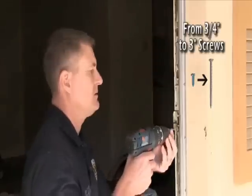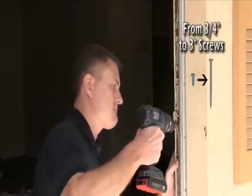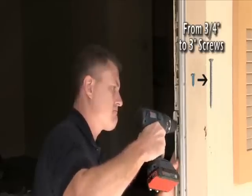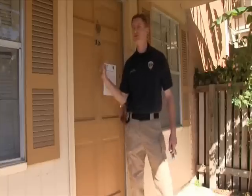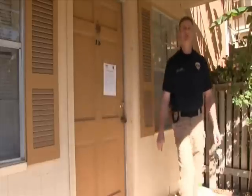That's the only thing keeping a bad guy out of your house. To this doorframe, we've attached a strike plate with three-inch screws. They'll actually go through the framework into the 2x4 itself. We're going to cue our burglar, and if it works out well, this door will be dramatically stronger than the previous door. Let's try it out.